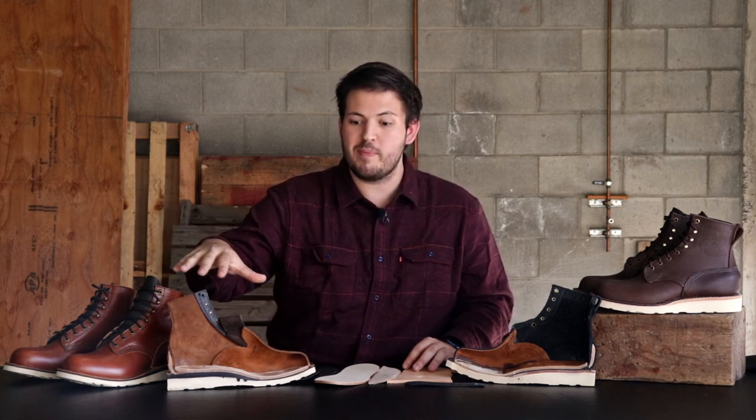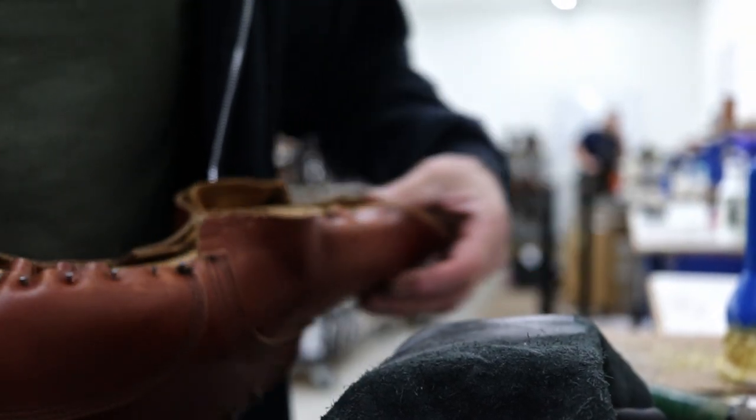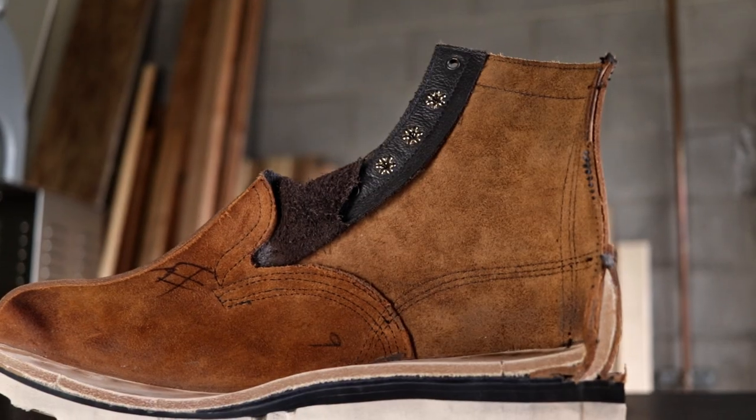With the 300, we went in a different direction — how can we match that lighter style so pronounced across America, but still a really high-quality build? This build is actually called a 360 stitch-down, and there's not a single nail in this boot. When we're lasting it, we do use temporary tacks to hold the shape and form, because we still last these boots by hand. But then all of those tacks are removed. The boot is assembled by hand with stitching and adhesives — sewn, stitched — but no tacks and no heavy nails.